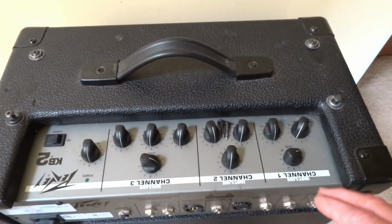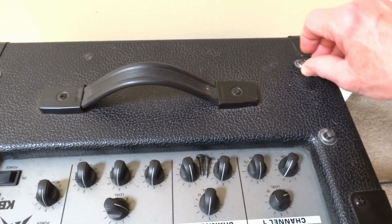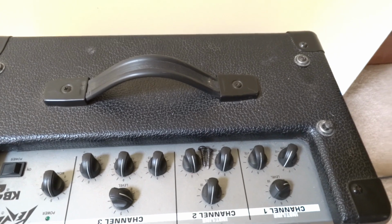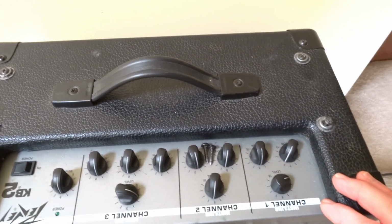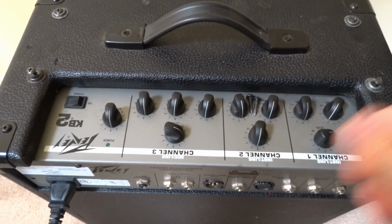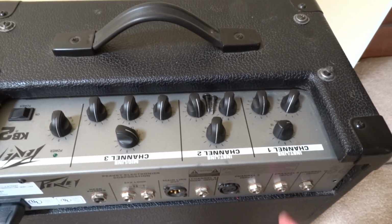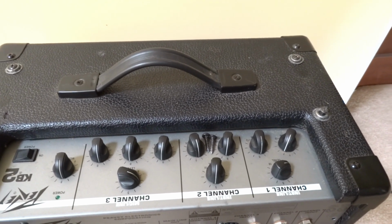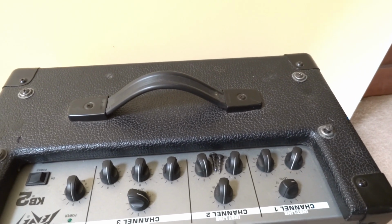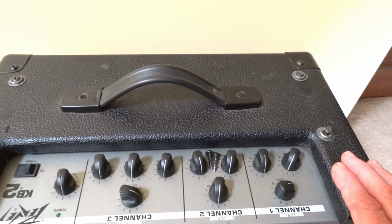I went to take it apart, and somebody else had been screwing around with it, literally screwing the screws. This one here is cross-threaded, can't get it out. The nut on the other end just spins. So I'm going to break out the Dremel tool and cut that one off before I can get the amplifier out. And talking to the guy, he also said that because of this issue, he tried spraying WD-40 into the jacks. I can't for the life of me figure out what the purpose of that would be, but that's possibly another issue that's going to need to be addressed inside this amplifier.